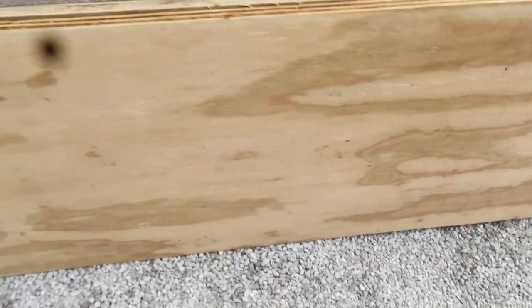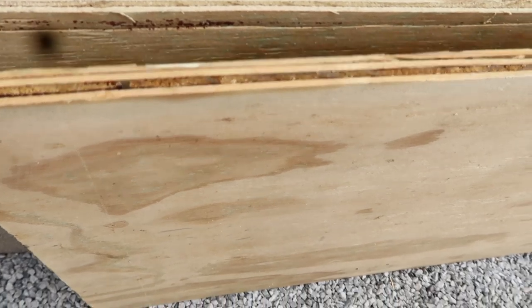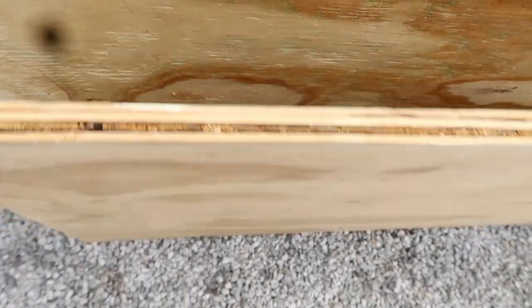So finally, we're gonna go over everything that we need to make it. First up, you need your base or whatever you're gonna be building the bottom part of your frame with. We're using a treated plywood. You specifically want treated if you're gonna be doing this method because it is gonna be outdoors. So we're gonna have 3/4 inch plywood. We're doing the width 2 feet, but to make things easier, we just got 1 sheet of plywood and had it cut directly down the middle long ways while we were at Lowe's because they do one free cut with your purchase of wood. So I do recommend doing that if you are gonna have 24 inches or smaller for the width of your table.